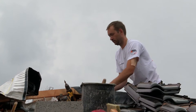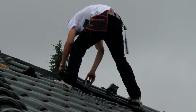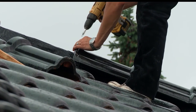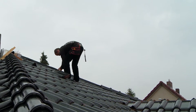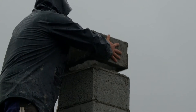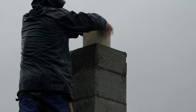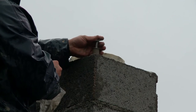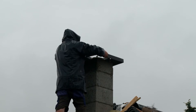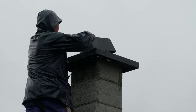The ridges are almost done too. A polypropylene fleece with folded aluminum edges comes over the slats — optimal for the rear ventilation of the ridge roof tiles, which are now placed over it. It's the final spurt for the roofers with the last roof tiles going on. The bricklayers are also on site again, putting the last chimney elements. The chimney has grown with the house bit by bit and has now reached its final size, with the chimney cover placed on top.